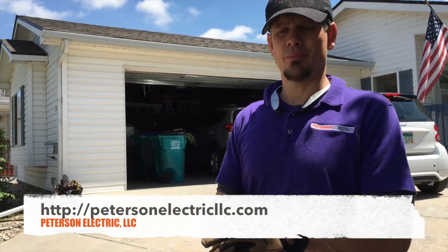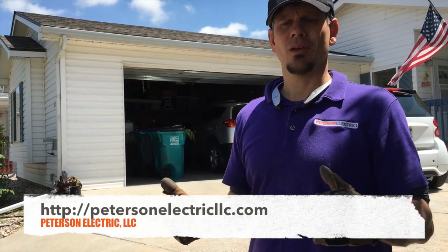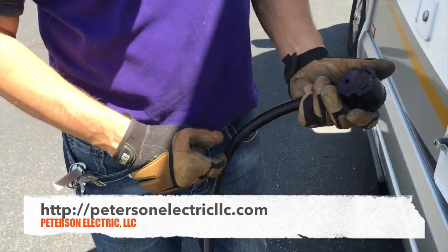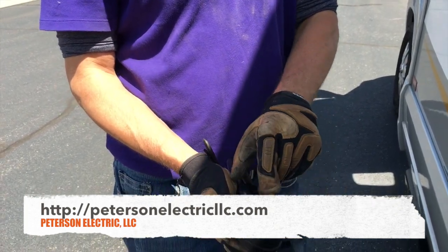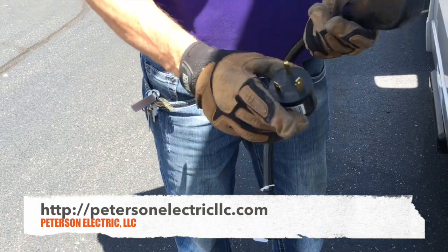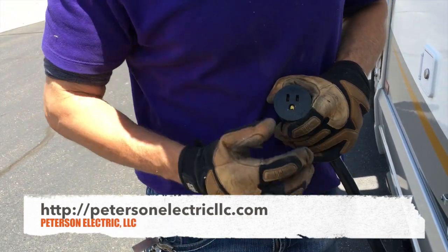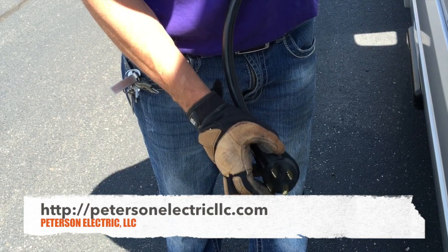We've gotten away with just a 110 plug that charges the battery, gets the TVs going, and powers the microwave, but when you're trying to run many items at once you need to know your amperage requirements and have the right adapters. When we went to Blue Mesa, all their hookups were rated at 30 amps but didn't have a 50-amp four-prong. This cord here — it's a range or oven cord — the straight L-shape means it's a 50-amp four-wire. This adapter will adapt it down to 110.